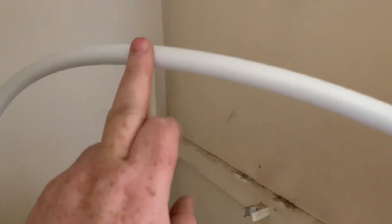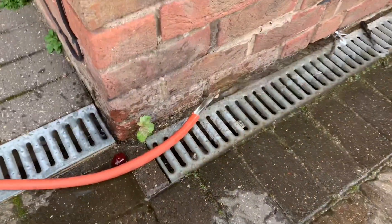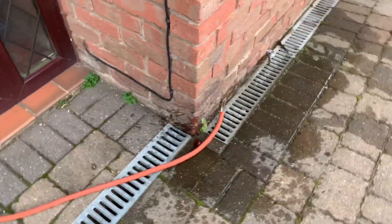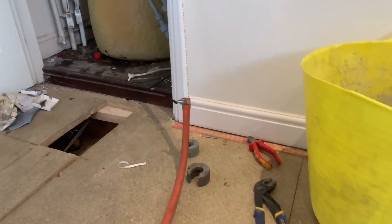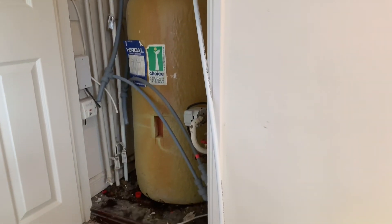I've connected a hose pipe and it's draining downstairs into the toilet. I've got a visitor from YouTube today. The drain off was seized, so I've put a pipe inside the cylinder and I'm going to siphon it out — that pipe goes down to the bottom of the cylinder. I sucked on the end of the hose downstairs and it's working like an old-fashioned toilet siphon, draining down the hose pipe. The cylinder is now drained down.